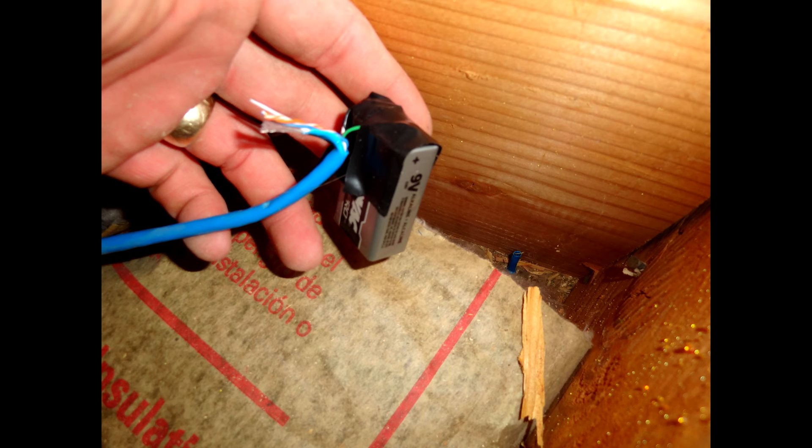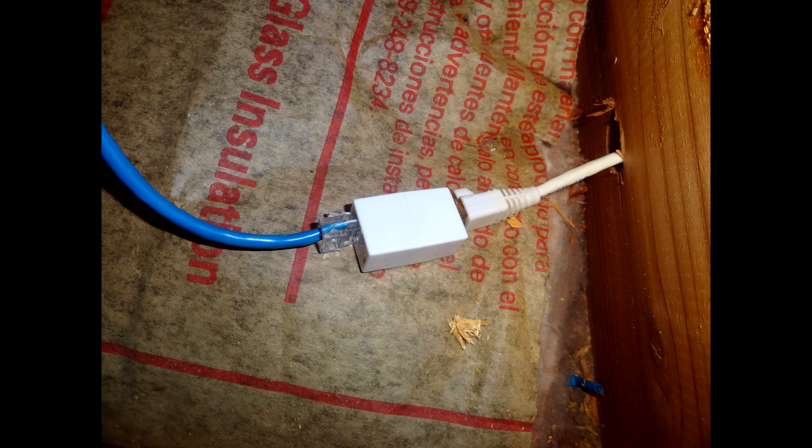Learn from my mistake: take a 9-volt battery and connect it to two wires down in the bedroom. Then go up into the attic, use a multimeter, and find the two lines coming out of that room. Find which one of those lines has 9 volts going to it — that's the line you're going to use for your Ethernet jack. The other line, just use electric tape and tie it off. Once you find the correct line, go ahead and crimp and put an RJ45 connector on it. This is where you'll utilize your inline Ethernet connector to add length to it — in this case, I added line to go to my switch box.